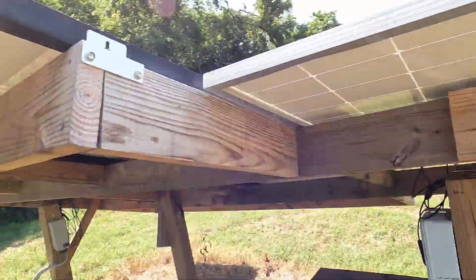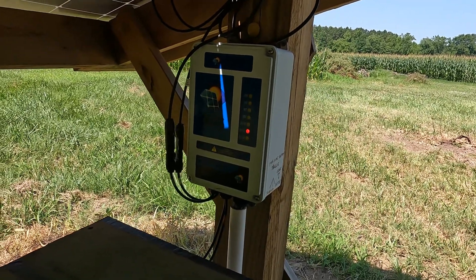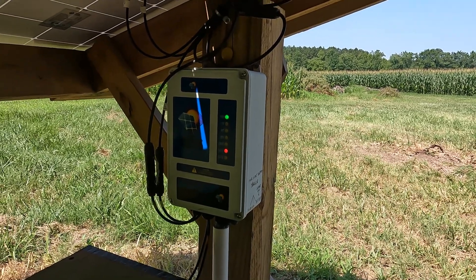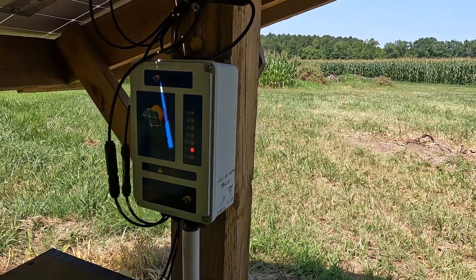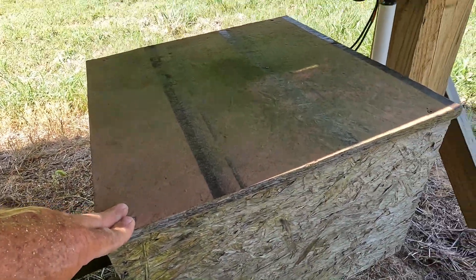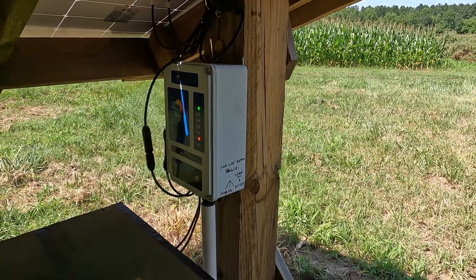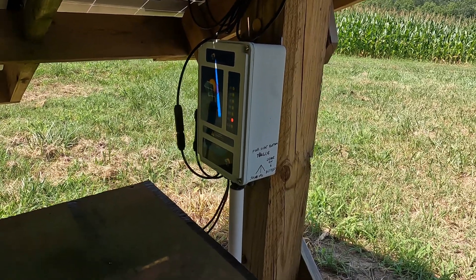Here at the off-grid cabin, I'm going to upgrade my power on my solar pump unit. That's an RPS solar pump unit, 200 series, and it comes with two panels. It's fine during the daytime when the sun's out, but in low light in the morning or low light in the afternoon, it just doesn't put out enough power — it goes right to the batteries in this box here. They work alright, but not as well as full power. Adding two more panels will let it charge faster and give more power to the pump so it turns faster and harder.